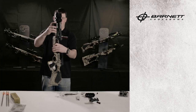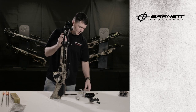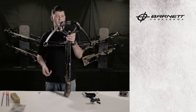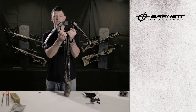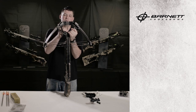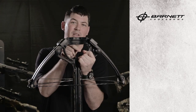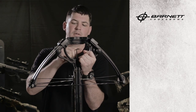At this point we're going to remove the bolt and install it on the end of the stock. Inside the parts package there's a lock washer — make sure it's on the riser bolt, and make sure the riser is seated all the way onto the front of the stock. Screw the bolt down into position, making sure it's snug, but do not over-tighten — over-tightening will strip the screws inside the bolt insert.